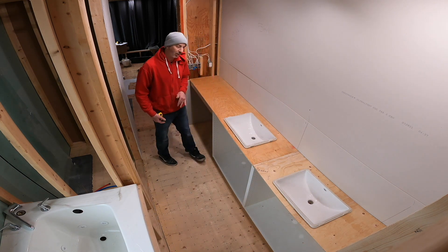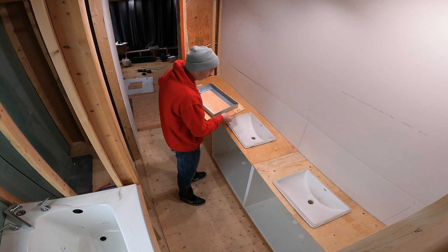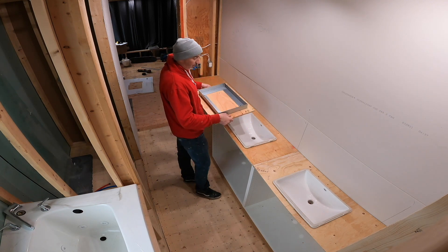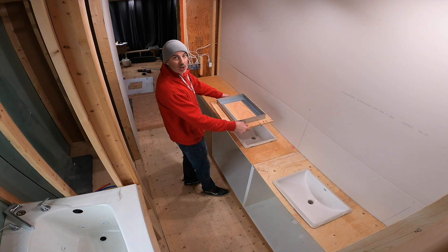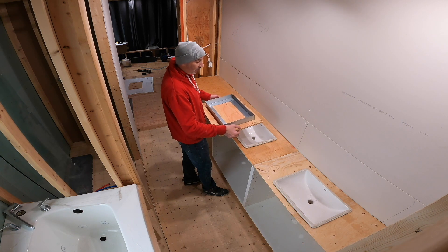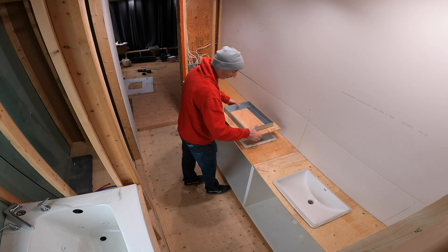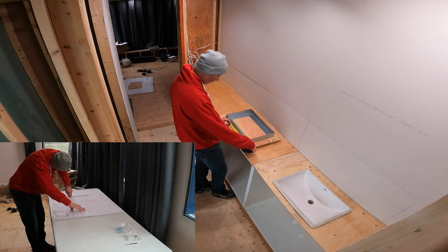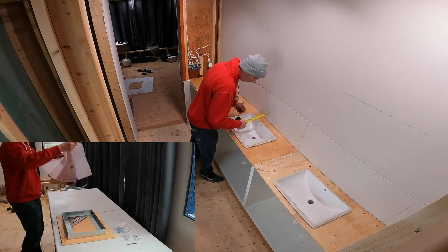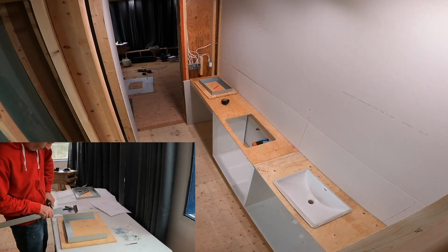Here's my sink positioning. Here's my form made up for the undermount sink — I took the dimensions for my steel right off the template that American Standard supplied with the sink. I set this over top, make sure it's positioned perfectly, trace around it, and that's my cut line. Once I've cut it in shy just a quarter inch, I'll put it up underneath and that's how the sink form gets created. I built the sink form using the American Standard template, two-inch by two-inch 20-gauge steel angle, and half-inch plywood. To fasten the steel I use wafer screws — definitely use your square to square the steel.